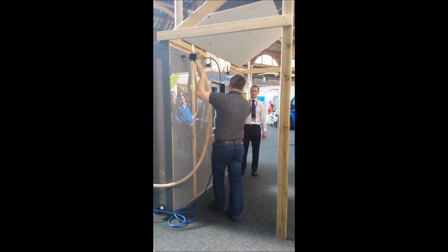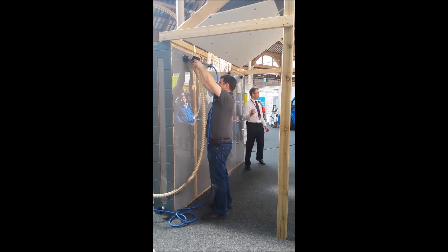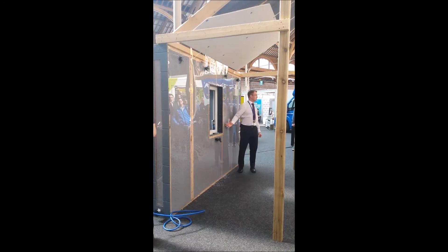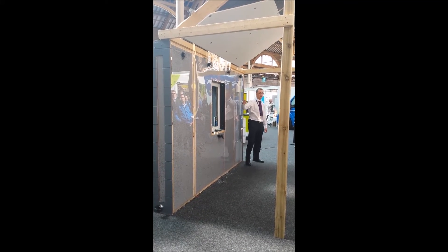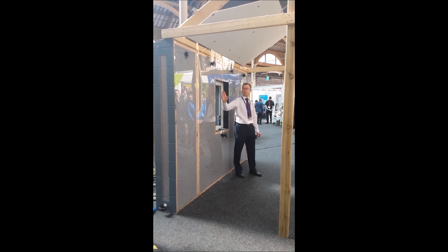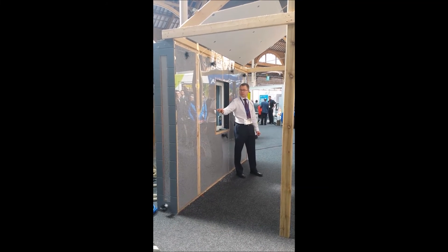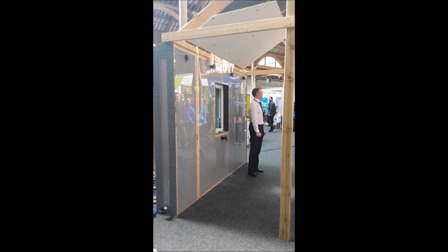When it's pumped in, it's pumped in with a small mist of adhesive. This adhesive bonds the material together so that if you were to come back later at your structure and want to put in a window or a door, it holds up so it doesn't fall out of the wall. So if, on the very off chance, you did get a small bit of moisture from the outer leaf into this product, the way it forms with the honeycomb effect, the moisture will dissipate, and at most it will only come in maybe 10mm into the product.